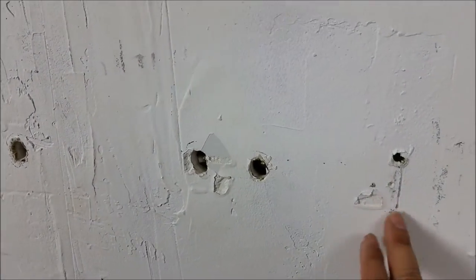Some other stuff you might need is a drywall mud pan like this — if you're doing a big job or filling a lot of holes, you just put the spackle in here and smooth it around with one of these spacklers or drywall putty knives. I like using a bigger putty knife because it gives you smoother coverage versus doing many passes with a smaller one. They make them out of metal and plastic. You're also gonna need sandpaper — stay between 120 and 150, and definitely don't go above 220 to smooth out your drywall patch.